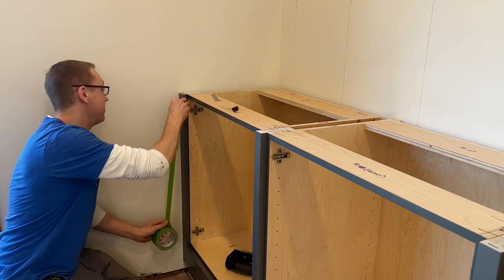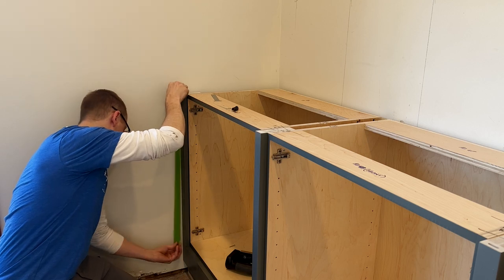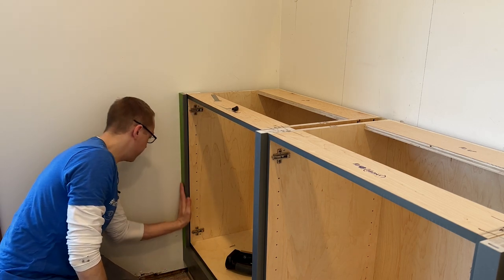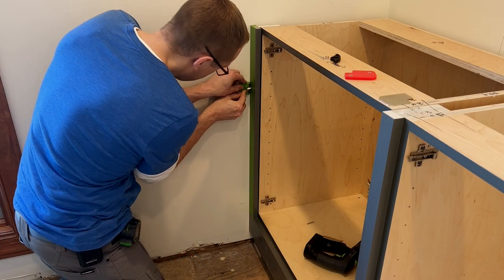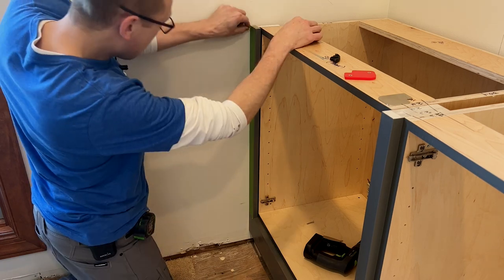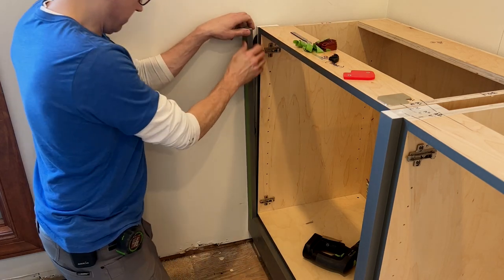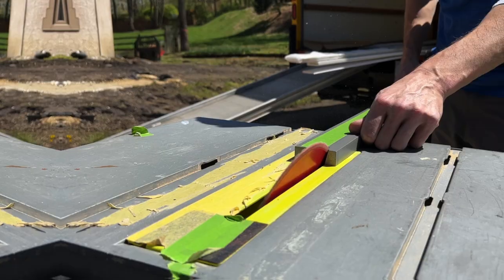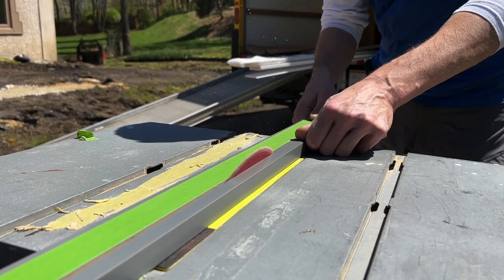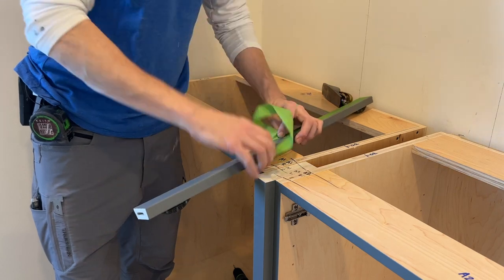For those of you who may follow me on social media, I am a green tape junkie — I do not like blue tape because I can't see on it as well. I'll just run a strip all the way down; doesn't have to be perfect. Now, using a marking knife and a 20 millimeter block, we will make our scribe line. Once the line is scribed, I'll remove that tape and head to the table saw to make the initial scribe cut and clean it up. I'm freehanding this on the table saw with my blade set at about a 10 degree back bevel, staying a little bit short of my tape line so I can come back with a block plane and clean up any inconsistencies. I'm creating almost an eighth of an inch square fillet so I don't leave a fragile edge when I go to push this up against the wall.